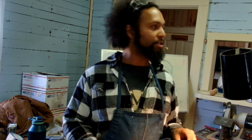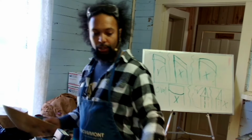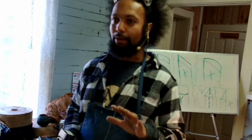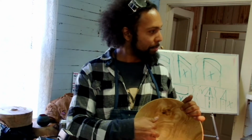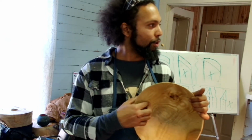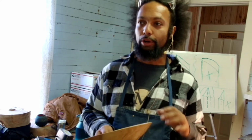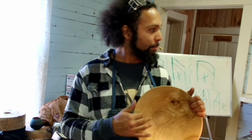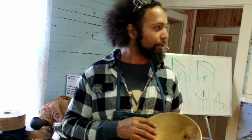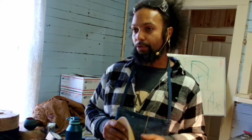That story changes on the interior when I need to actually take a much steeper ground bevel from the interior portion, about mid-third, mid-section, and continue all the way around. So that's to say that a 40 or 45 degree grind might be good for doing that shaping up to about the mid portion of a piece. I have to switch over to something that's about 60 degrees to be able to ride the bevel.